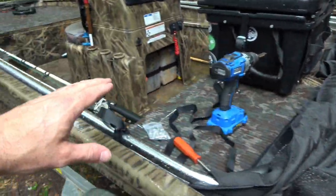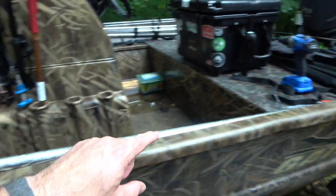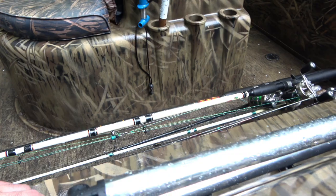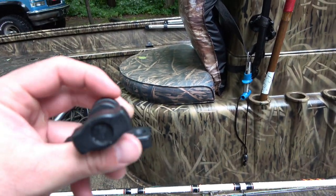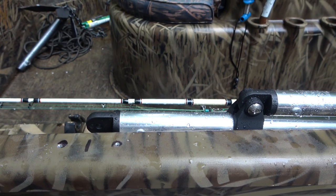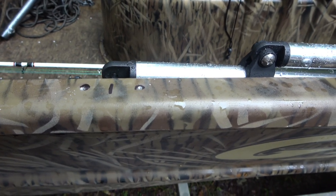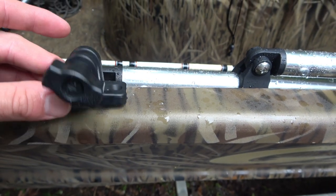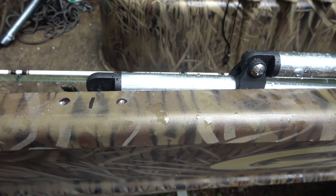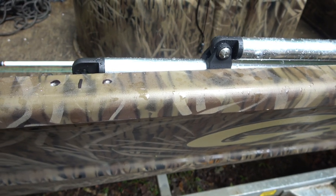What I did is eyeball the placement, and it kind of stays in place. I pulled a measurement with the tape and came up with about 98 and a half inches, so I put a little mark there and did the same thing on the other side. It comes with these little brackets — this is what actually bolts the bimini top to the boat. The instructions say it has tapping screws, and stainless steel screws will break in a heartbeat, so I lined the bracket up with my 98.5-inch mark and pre-drilled my holes with the closest size I have — an eighth inch — without going too big.